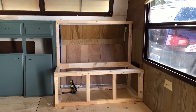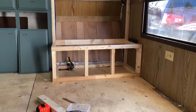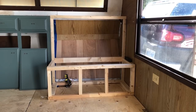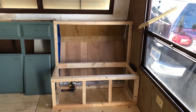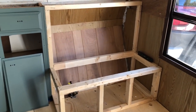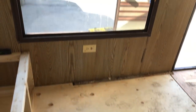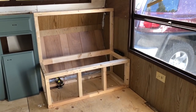We have the base of our main bench at the back all built. Next we're going to do some quarter-inch plywood along the back, some along the front bottom, and on the sides to frame it all in. We'll do a half-inch plywood seat lid that can hinge up and down for storage inside. We're going to add one more brace in the middle for extra support before doing the seating. We'll do the same thing on the other side using two-by-twos, tackle that in the next day or so, and then we'll be able to measure and figure out exactly where the table is going to go.